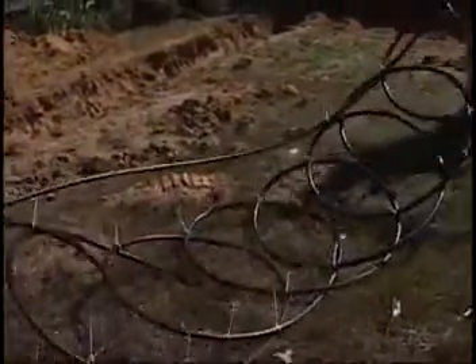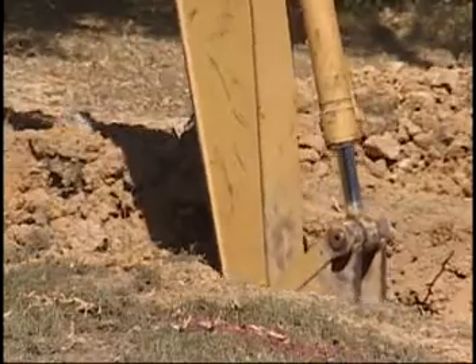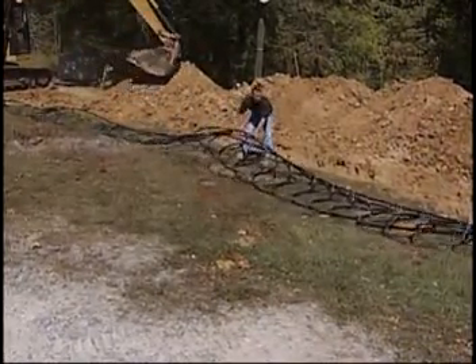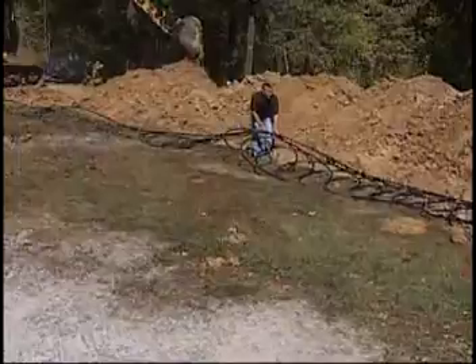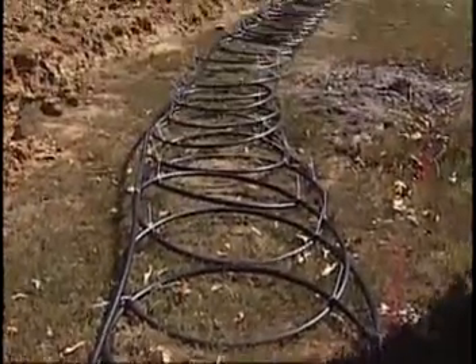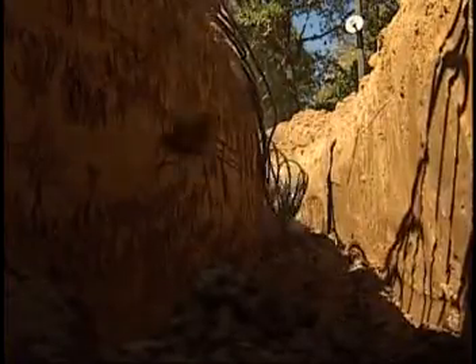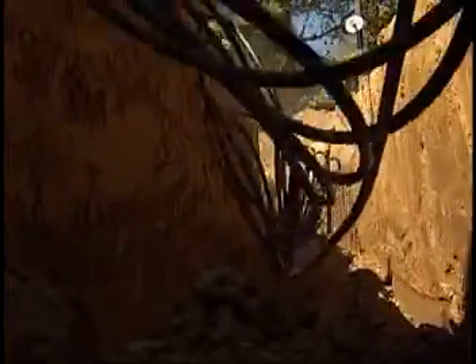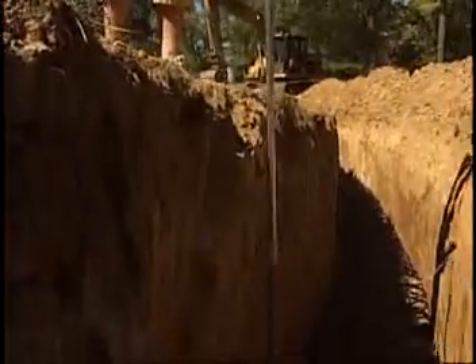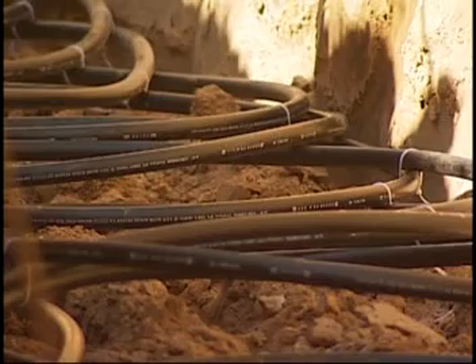Just a reminder: make sure you know where any water or electrical lines are buried in the yard. We have estimated a 65-foot trench for 600 feet of slinky loop. This will vary depending on the length of pipe needed to enter the header manifold. Now's the fun part — dropping the completed slinky loop in the trench. You'll need a long pole to push the loop into the trench straight. Make sure you mark the supply and return loop.